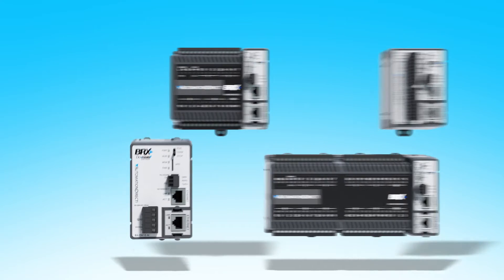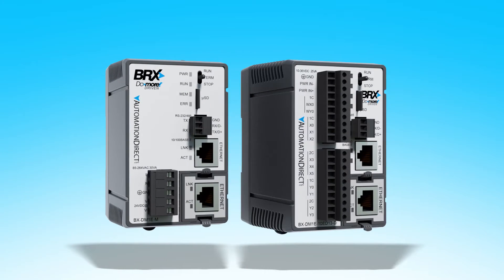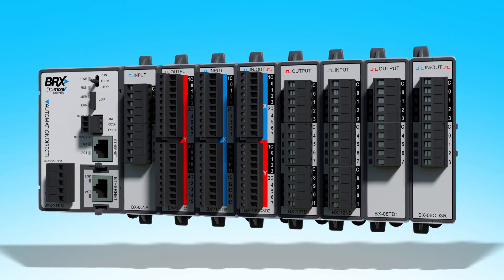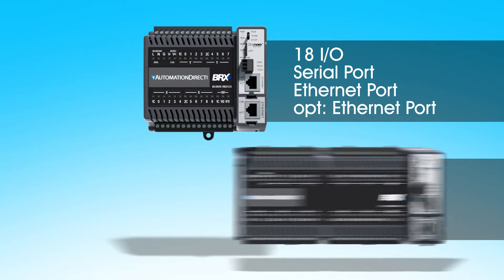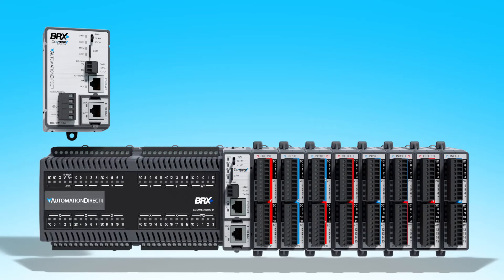You can use it as a simple PLC with no I/O for data logging and communications, a small PLC with built-in I/O, or you can add additional expansion modules to build on that foundation and get even more I/O. When you need more I/O than that, you can move up to units with 18 or 36 built-in I/O. These units have the same DoMore DM1 CPU technology, they just have more built-in I/O for larger applications. The Bricks PLC platform can take you from 0 to 164 local I/O points so you can build your own custom PLC system that precisely fits your application.